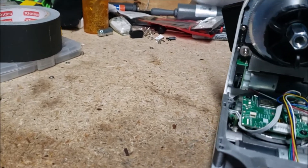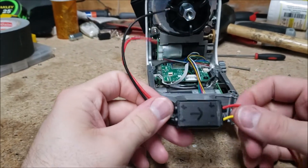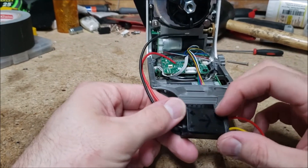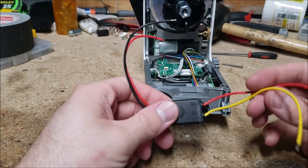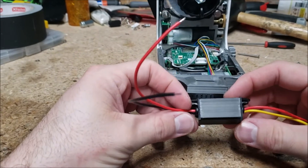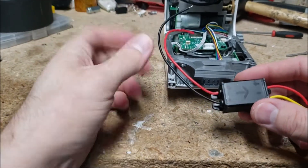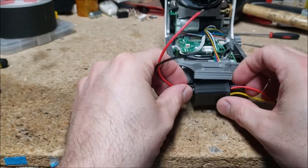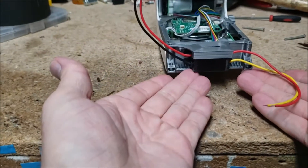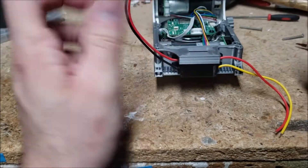I didn't have to do it in the corners because the device is not there. The device is this little 7.5-amp buck converter — it's pretty big. But I wanted one that was all sealed, wasn't going to short out. It's going to be connected to my DSLR, so I got a really reputable one and took the metal cover off and marked it. This is 12-volt in and then 7.5 out, so that's going to power my DSLR so I don't have to keep changing batteries in the middle of the night — everything will just run off my big battery. I'm sure I could have got something smaller, but this is a little weather sealed. 7.5 volts no matter what goes into it. So I think we'll be okay. It just sits up in there, and it will have the bottom cover and the front — it doesn't need to be super stuck in there. I'll probably put some double-sided tape on the back just so it doesn't wiggle.